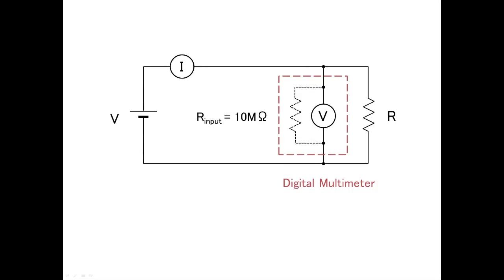However, when the resistance of the sample is very high, there are some problems. One is because of the input resistance of a voltmeter. Usually the input resistance of a digital multimeter is about 10 megaohms, and this limits the value you can measure. It could be 10 gigaohms in some instruments, but then you can only apply 10 volts or so.